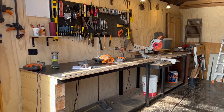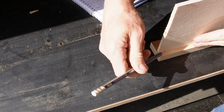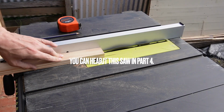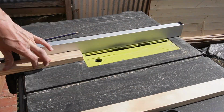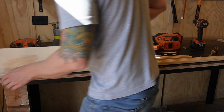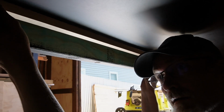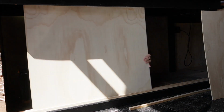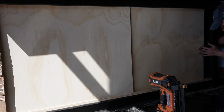Then back to finish the workbench by building some sliding doors. First creating a track for the panels to slide on, using a new stick of pine and using a table saw to route out some tracks. Screwing those down, and installing a simpler track for the top using just one piece of timber and the back of the apron. And voila!